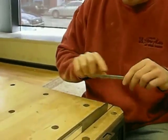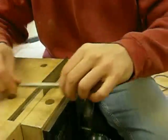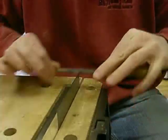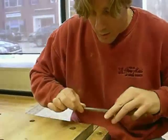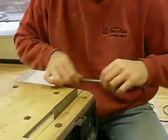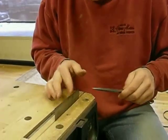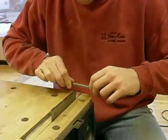Put a little on your burnisher. Now, watch this. Can you see in there? You put much pressure on that? Hardly anything. And now you just want to tilt it a little bit — you're rolling that edge, right? You can hear how I'm pushing down on it. I don't like to use drill blanks or whatever. This is very dangerous, Al. I've seen people stab their hands and they get too excited when they do this. You really just got to be careful because this thing right here is very, very sharp. This is like my favorite tool, once I learned how to use it. I can just barely feel that there's a little burr on it — a rolled edge. That's good.